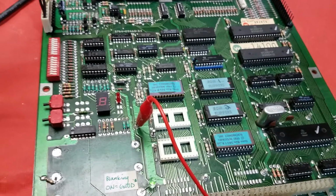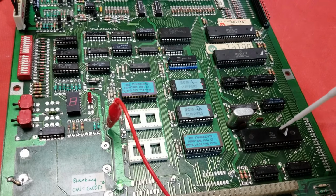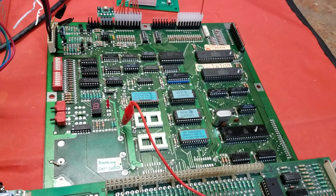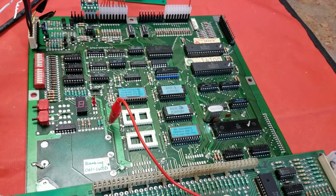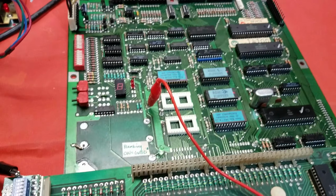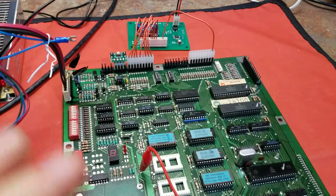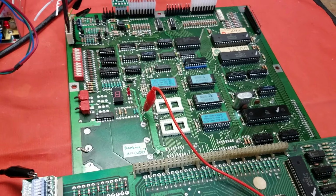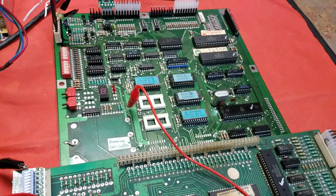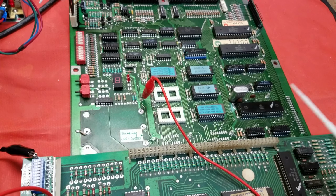And then I noticed that the CPU processor, the 6802, this one happens to be an 08, but the 6802 on that other board set was a brand, and I bet you can guess where I'm going with this, AMI. That AMI CPU had failed, and I just swapped in a working one, and then my diagnostic test came right back. So besides having to change everything out, I had a couple of pretty easy repairs, just knowing that that AMI brand of IC is always suspect. The first board set had a bad AMI PIA, and that second board set had a bad AMI CPU.